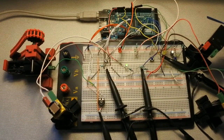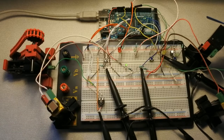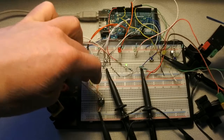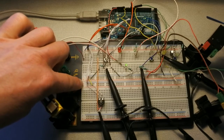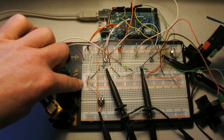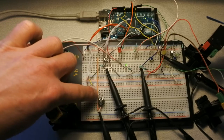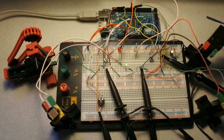Why would the potmeter, this one, be 0? Well, it can only be if the power is 0, and that turned out to be the case. Red and blue, plus and minus, power and ground, are not automatically connected. So now I have connected them, then it works out. And then the point is how to connect them.